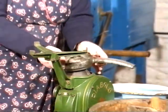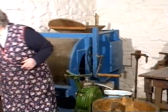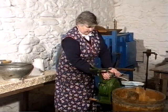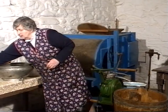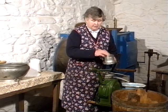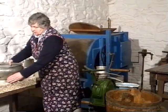Now it's done. This is the spout for the skimming, so I turn that towards the top. This is the spout for the cream — it goes on top. Cream is lighter so it rises to the top. In this there is a float to regulate the flow of milk, and I put it on top here. This is the bowl for the milk and you put it on top here.